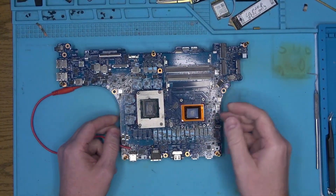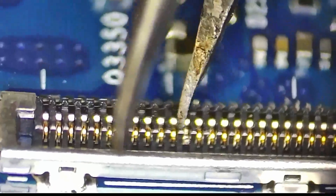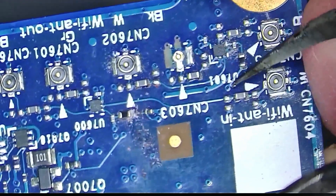But after struggling for a while it seemed impossible to do with this type of hook, so I ended up just soldering the wire directly to the filters. Before I powered the board, a visual inspection can provide us with some useful information, such as this pin looks different from the rest, and some signs of corrosion near the NVMe slot, as well as the broken antenna socket.